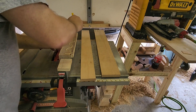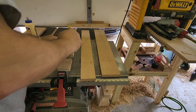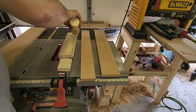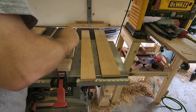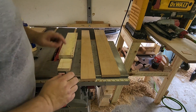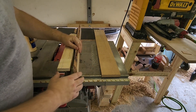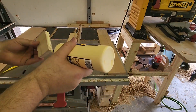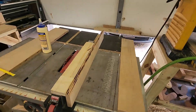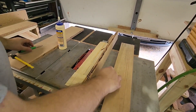Don't need a lot of glue here. Basically I'm going to use just enough to hold it in place. I'm going to shoot a couple of brad nails into it as well. Using this block as a spacer, I'm going to flip this one over and line these two front corners. I made a pencil line — I want to keep the glue below that line.